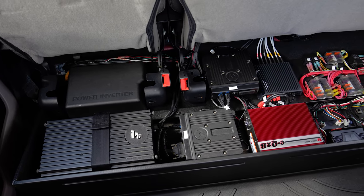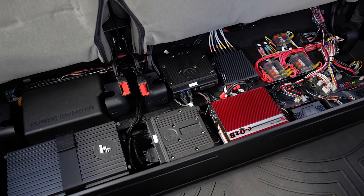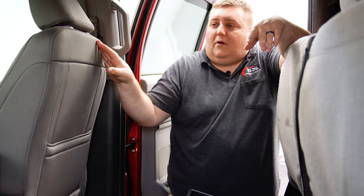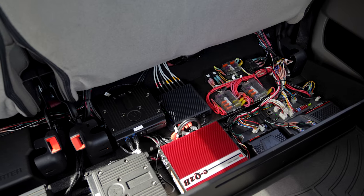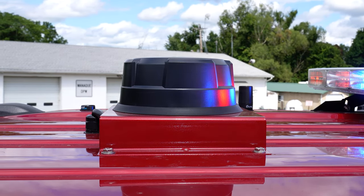Taking a look at the under-seat electronics compartment: most of our electronics and distribution are here. We've got our core system with external amplifiers, fuse panels, our CradlePoint modem with outputs up to our front docking station and into the back cabinet for computer power. We've got their FutureCom repeater system along with their Apex chassis, the EQ2B brain, and the tracer amps. For the CradlePoint's large antenna on the roof, we fabricated an aluminum panel to bridge the rib gaps and painted it to match the truck.